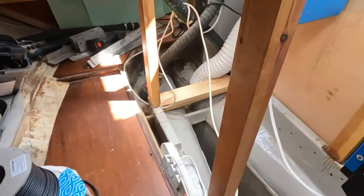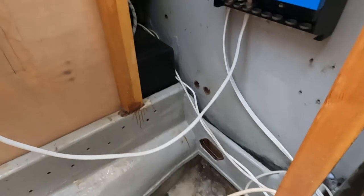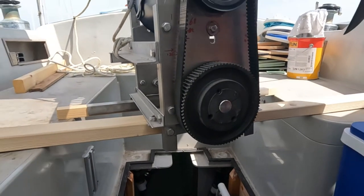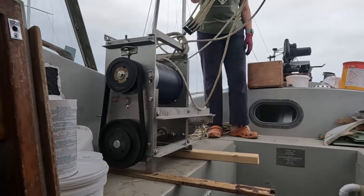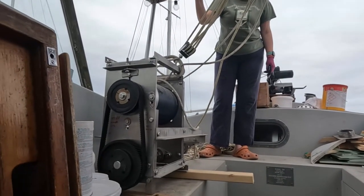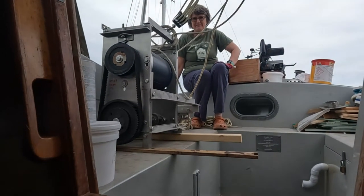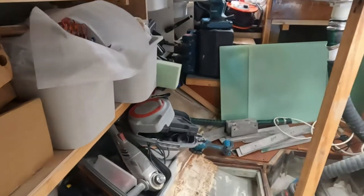I started working in the motor room with the motor lifted just partially, and I got fed up of banging my head on it, so we've now lifted the motor right out. We can have a look at our positioning of the electric motor resting on some beams, doubly tied and sitting in isolation in our cockpit. Jane is able to pull on the block and tackle and lift the motor, and we can manhandle it sideways onto the cockpit seat. We did get the diesel engine out ourselves a couple of years ago and this is infinitely lighter and easier, but that will give me space to go and put the bilge hole drains on the port side.